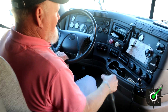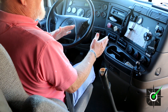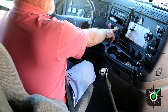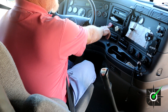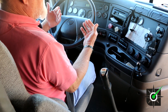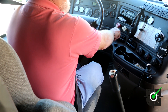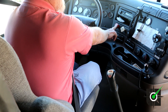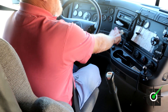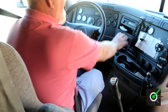First thing you do: put it in the lowest gear. Push in your parking brake and we're going to check the trailer brake. Ease off the clutch — make sure the trailer holds and doesn't let the truck roll. That's all you have to do. Now we'll depress the trailer brake and we'll check the tractor brakes, the parking brake. Same thing.